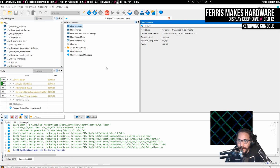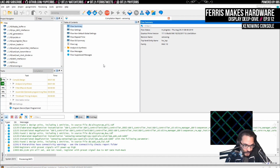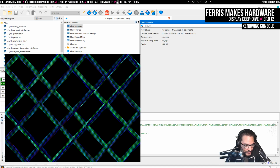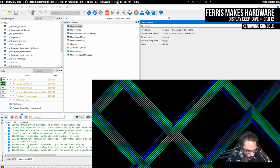But again, the annoying thing is that this IP always generates warnings, which sucks. But at least if we flash this again, if we build this again and flash it on there, I could do the slow path again and then reset it. And then if that works, I'm going to commit it. And then I'll try again to simplify that load timing. So I think we probably won't see it here, but I guess it doesn't matter that we issue the reads early, as long as they get to where they need to get by the time we need them, which should be the case.